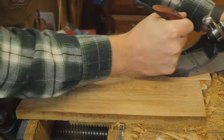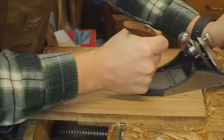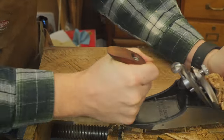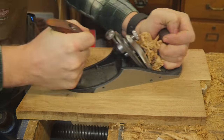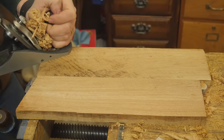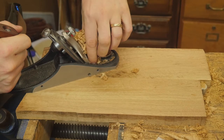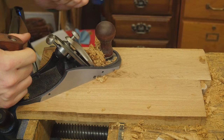And with this, I can get a really nice clean surface. Now this board, I currently have a little bit of a belly in the middle because I was using the card scraper. But a little bit more work — I'll show you what this will look like. You saw the picture a little bit earlier of this curl and the tear-out in it. So let me spend about five minutes or so smoothing it down with this, and I'll show you what that looks like afterwards.